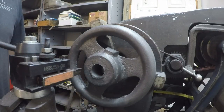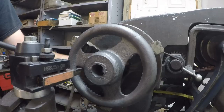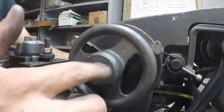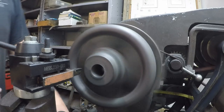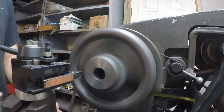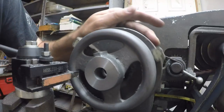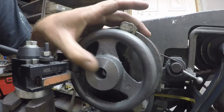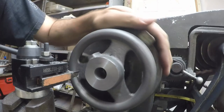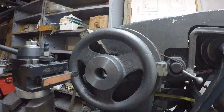I don't have a carbide boring bar. I probably should get some, but we're a poor shop here. The face-off was left at this little lump right here, then we'll get to work on the big part. Getting kind of close. I want to see what kind of finish I'm getting — boy, that's really rough. I'm going to see what other cutters I've got. That's kind of a bearing surface so it needs to look pretty good and smooth.